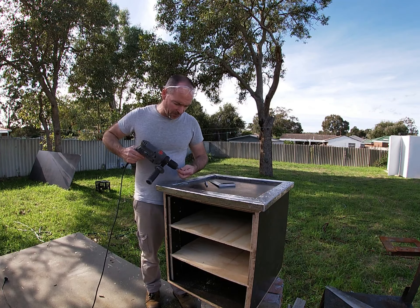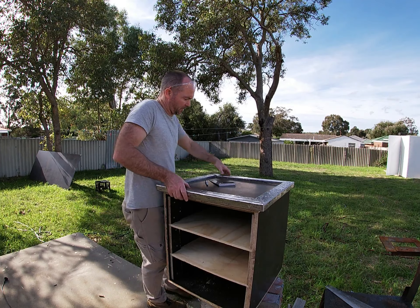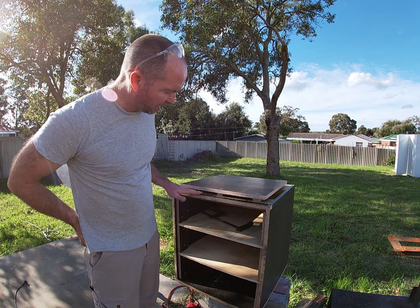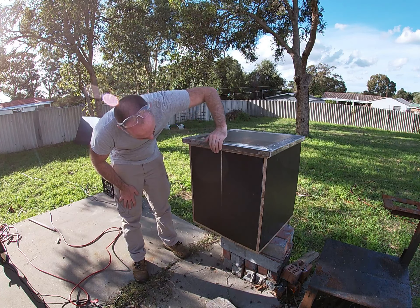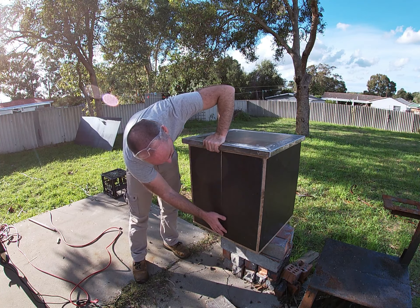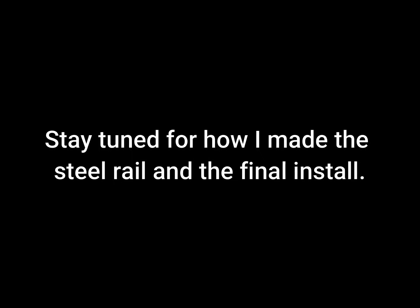I'll just run some diagonals on these just to check that they're square. So the next part of the job is going to be putting something down here — this will provide the hinge place to screw into and it'll also provide something for the door to stop against. Because these will also be supporting the shelves, I've just got to cut them so they also help space the shelves out. So I've worked out it's 580 minus the 24 — or two lots of 12s — for the shelves: 185. Measure that in here: 185, and then 12 mil.